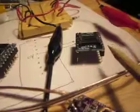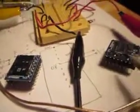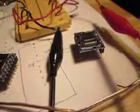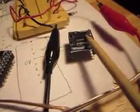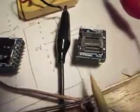And also I noticed the leg here, the pins are angled. This particular one is angled outward, which causes these pins to lean in a little bit toward the metal. So when they solder it, the extra solder or the overkill on solder causes these pins to short against the metal cover. And again, the same pretty much applies to the other side as well. It's also angled very badly going outward this way, bringing the pins here, the solder joints, closer to the metal. So that's one issue that I'm going to have to fix on these, and any of them that I use, that has to be solved.